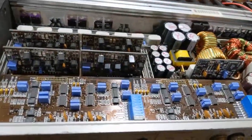Now that we've got the board out, we can look at what we need to do. One thing I did notice is this board is falling apart — that plating on the through-hole came out real easy, and I used an actual professional desoldering tool. I don't see anything burnt, because normally when these surface-mount resistors go bad you tend to see a hole in the top of them. But I do notice quite a few of them have cracked solder joints. The rule of thumb with these JLs is you need to re-solder with fresh solder just about everything surface-mount on this board — it's a known problem. The solder joints for some of these power transistors are also very sketchy.